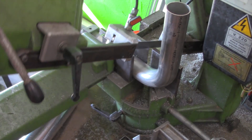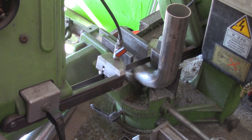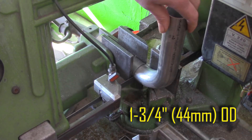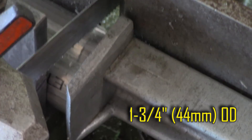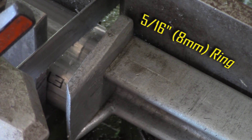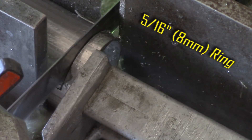Let's start with the tube. Now, this is a piece of stainless — it is a mandrel bend, but I don't need the bend. I'm just going to cut the leg off of it because we need some straights. Any straight section will do. Inch and three quarter diameter is exactly what you need. As soon as you have that straight section cut, we'll get in and measure out five sixteenths of an inch and we'll cut ourselves some rings.